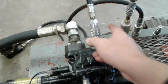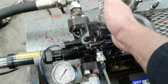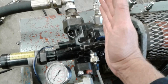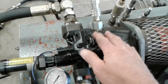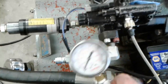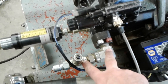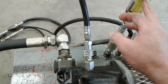flow. And that kind of answers the question that people learning about load sensing hydraulics often have: when the pump's fully de-stroked, we know the swash plate doesn't actually go completely to zero angle. There's some angle to it, so the pump is still producing some flow, and it always confused me when you see the pump output blocked, or even blocked by a closed center DCV, where's the residual flow going? And this basically answers it.